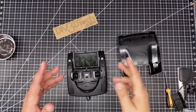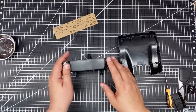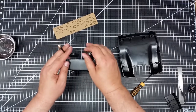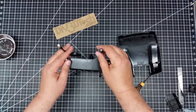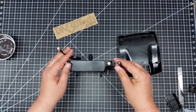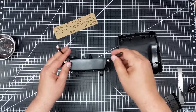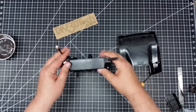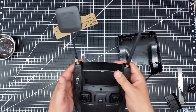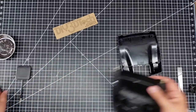It's worth keeping in mind. Let's go ahead and do a quick time-lapse of the reassembly. I also want to mention that these are both standard SMA connectors for both the 2.4 and the 5.8. I think these are SMA females — it's not the RP version where it's reversed. So it doesn't matter which one of these you use, at least in this kit, because they both have center pins. They just screw in here respectively.